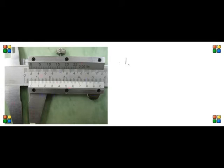On this one, I'll give you a little time to try work it out yourself, and remember to use the two-step method and then add them up. And of course, the Vernier scale is decimal whatever lines up. Well, I hope you're right, and that's it for the three examples. I think you can see how easy it is to read a Vernier caliper with the metric scale.